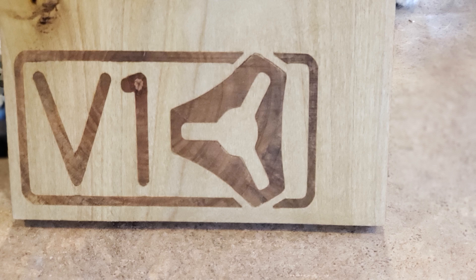Overall I'm quite pleased with this technique. If you look closely, all the edges are nice and tight. The maple looks better in that wood than the wood I used for the F-Engrave, which might be a slight disadvantage when comparing the two. It's certainly glued up nice and tight. However, if you look closely back at where I put it in the vise, you'll see there is a significant gap — so I don't think there's much of the inlay actually in the inlay. I think it's quite thin.